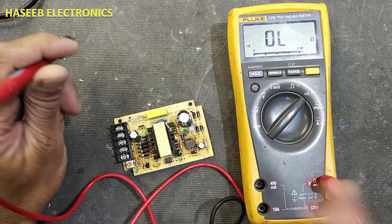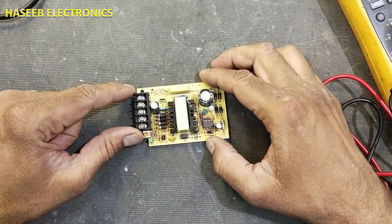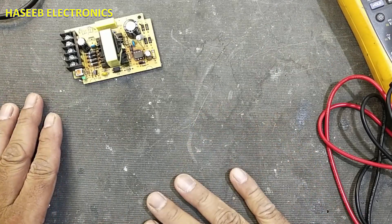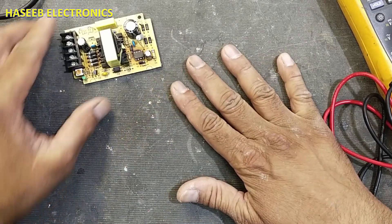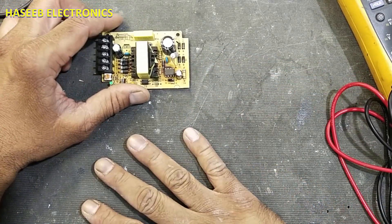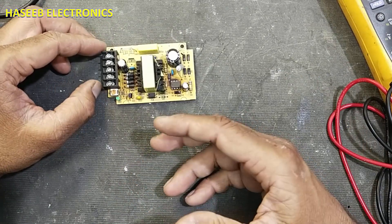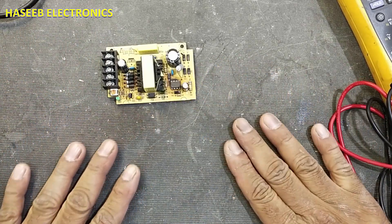What points must we take care of? First, we will be dealing with live electrical circuits — we will apply line and neutral. Use a wooden table, then use a neutral rubber sheet so that there should be no electric discharge through the table. If you are using a wooden table, it must not have any metallic nails or metallic connections. Your chair must be a plastic lab chair, and you must isolate yourself — for that purpose you can use a wooden rack.